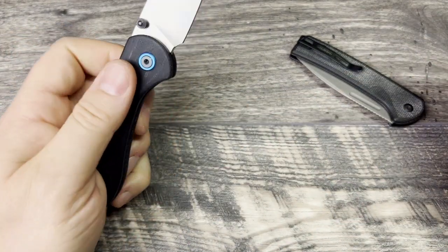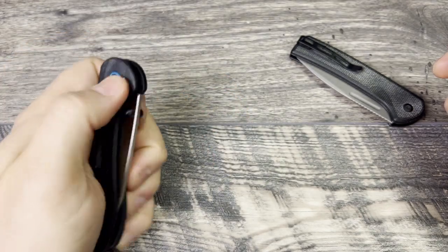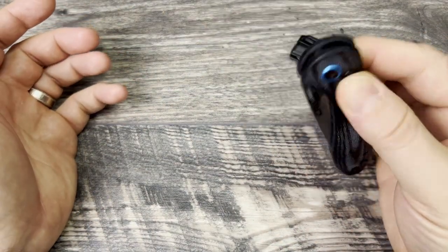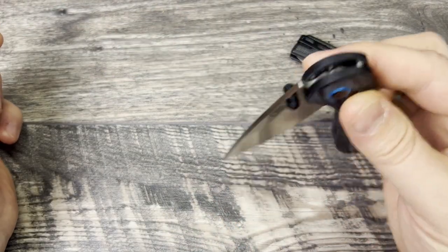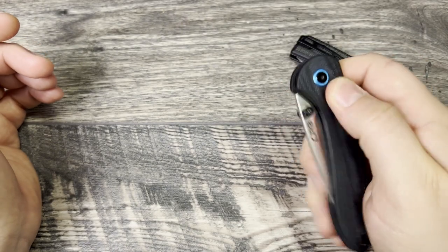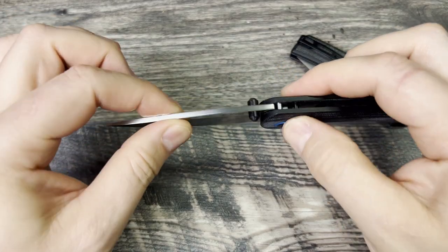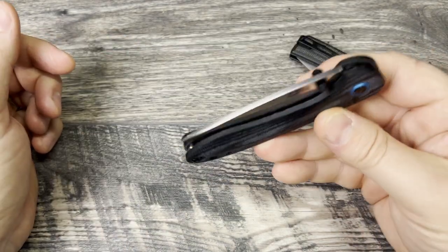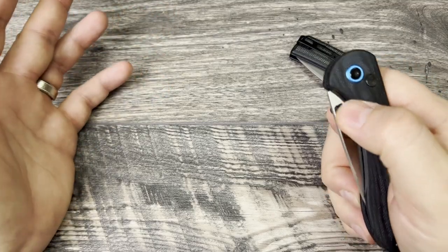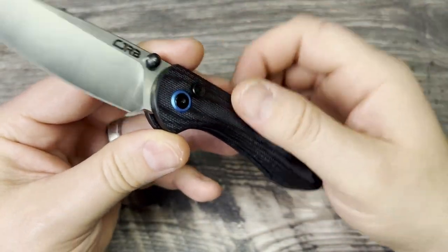The detent is very heavy and you can't really reverse flick it. It's a little concerning because there's nothing to grip onto, and with the detent so heavy and having to push so hard, the knife wants to move around a lot in hand. You only have the one means of deployment. However, the action is smooth from the button to close, and the lock stick I had is completely gone. It is really smooth, it will kick out, and there's absolutely no lock rock side-to-side. There is no pivot lash or side-to-side play with the button disengaged.